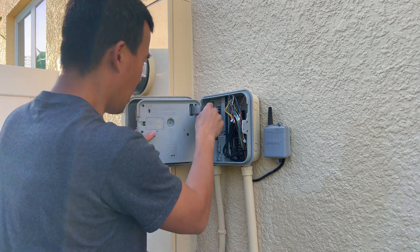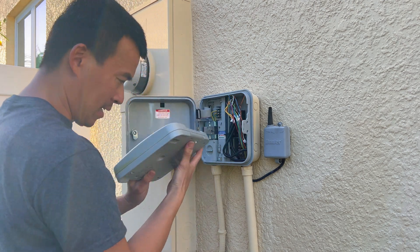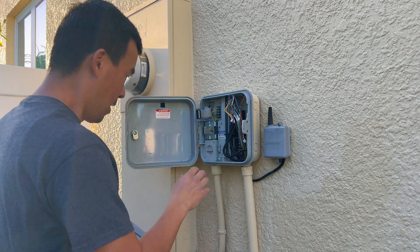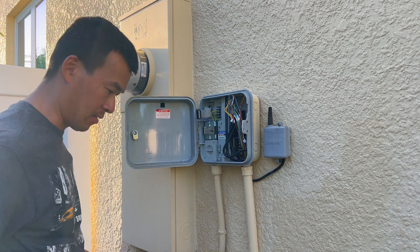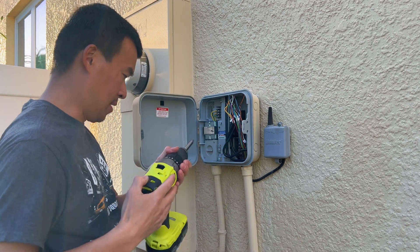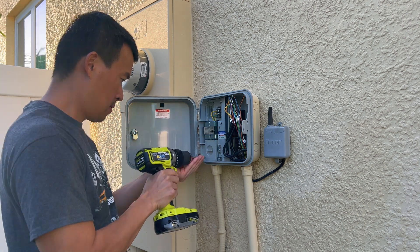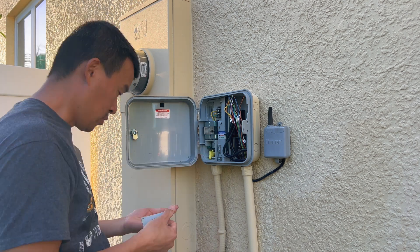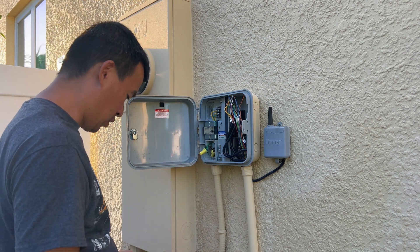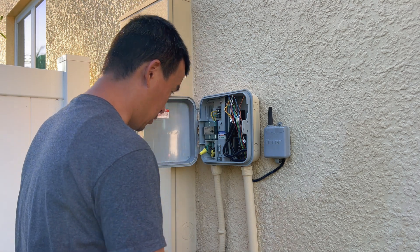You can undo the ribbon cable from the Hunter, release the whole thing, and the whole control panel comes apart — put that to the side and start unbolting everything down here. Pull this part off too, and then disconnect the power. You want to make sure all your power is disconnected and turned off on the breaker so you don't electrocute yourself.